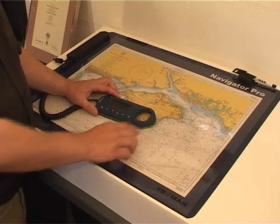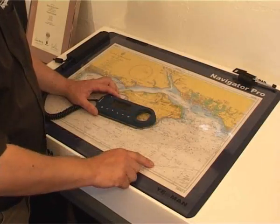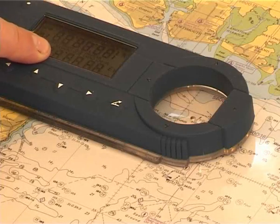The Yeoman mode is just a simple method of doing your chart work. Say for instance you want to find a position on the chart. Normally you'd be looking at a position and then plotting it from the side of the chart. With the Yeoman, you simply move the puck to that position and there's your latitude and longitude.